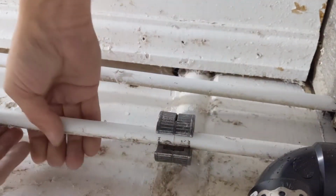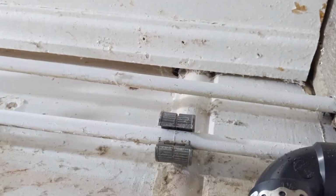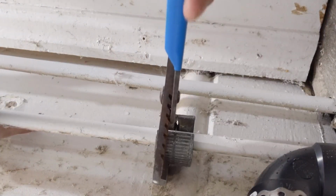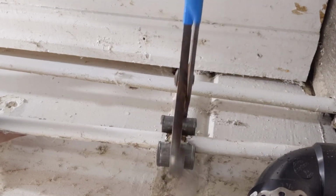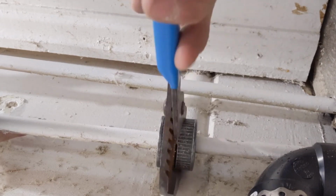because unfortunately these sediment faucets don't get used for so long that when you actually need them, they fail. And unfortunately in this building, the entire building has to be shut down because there is no secondary shut off. And I like to use the ball valves in a situation like this. I find they just last longer.